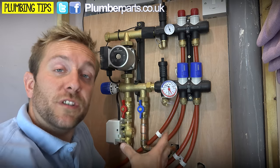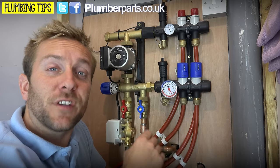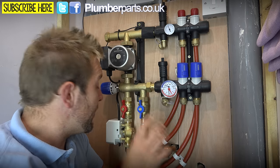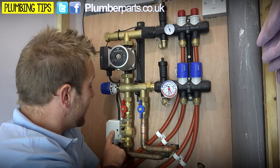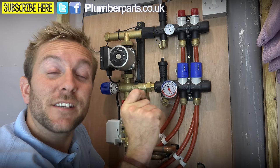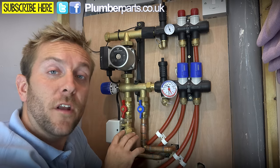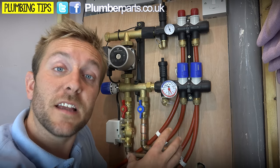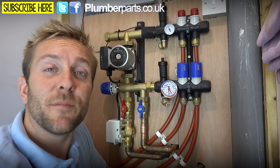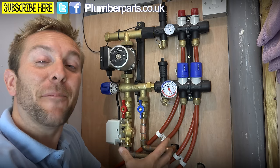Now, the electrical sequence for how this works is the thermostat in the room will prove, it will say I want heat, or the programmer and the thermostat will say we want heat at the moment, and then that sends a live supply to this valve here. And when that valve opens, there's a micro switch that clicks and then sends a separate live supply over to this pump to say I'm open, I want to come on now, and it also sends a live supply to the boiler as well to say we're open, we're ready for business, get us some heat coming through, and that pump's also going to go, let's run. And that's what happens basically.